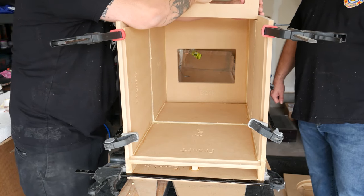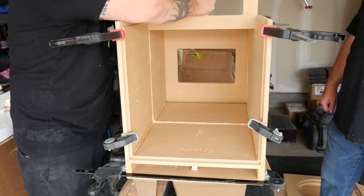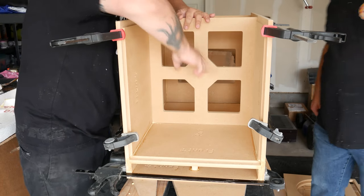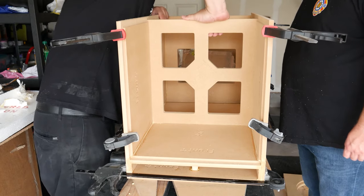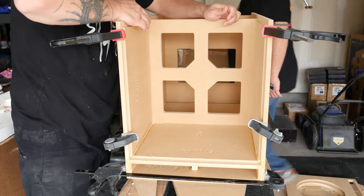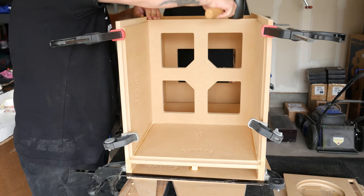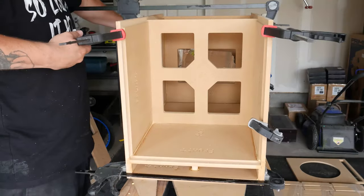Here's the centerpiece going in. You can see that beautiful logo facing the front — take your mallet and just smack it down a little bit to make sure it's nice and fit. Now, here's something I didn't do and should have done: I should have used a clamp to apply pressure to it, and this is going to affect something that happened later. I will show you when it happens so that you won't make the same rookie mistake I did.